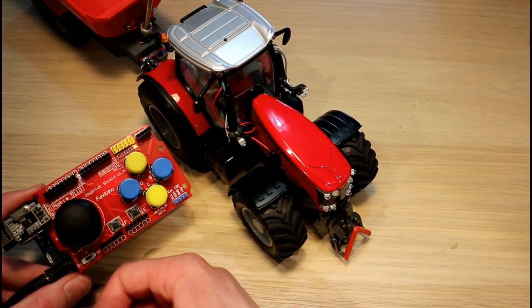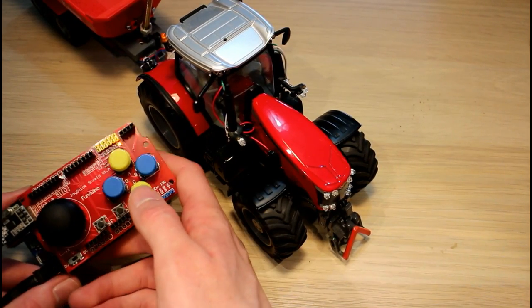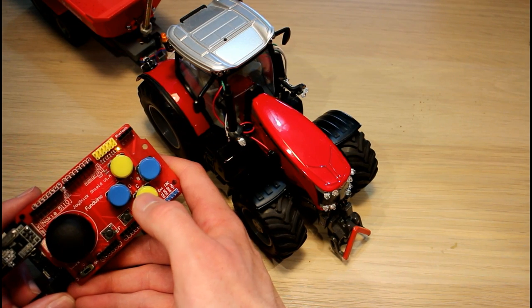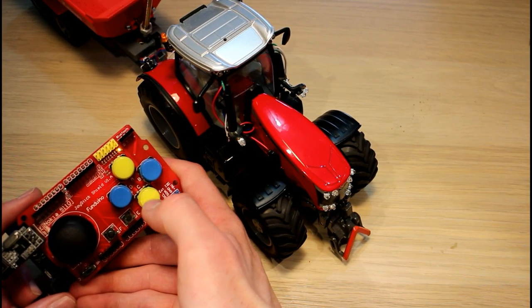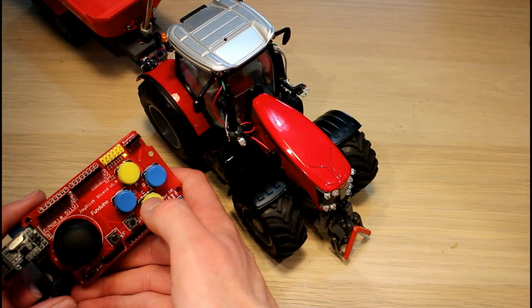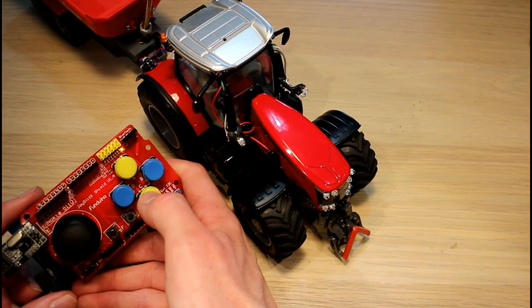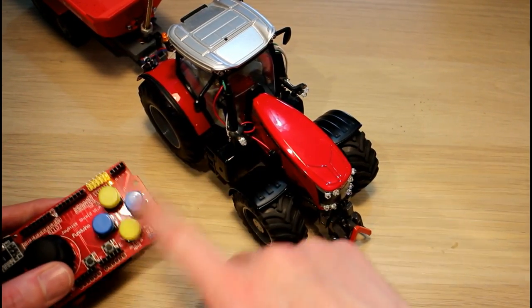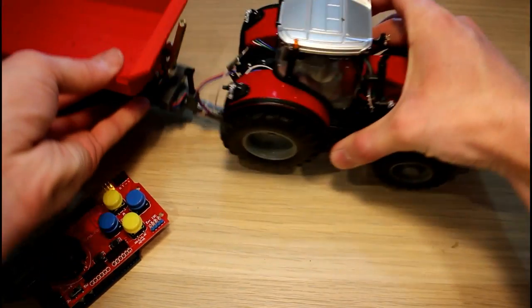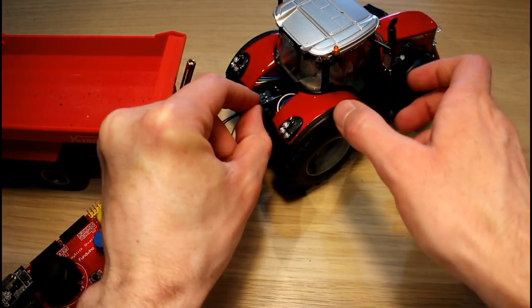That was the D and B buttons for indicators. When you hit the A button you should get your headlights. Now the C button should turn on the lights on the top, but there looks to be a slight problem — the lights are flickering. I think that's a debouncing issue, so I may be catching the debounce for button C. I'll have to change that in the code, but it will be fixed before you get the code.